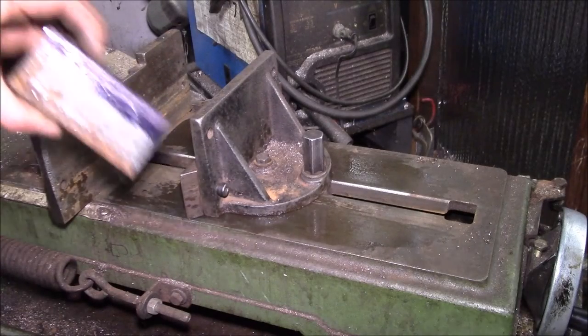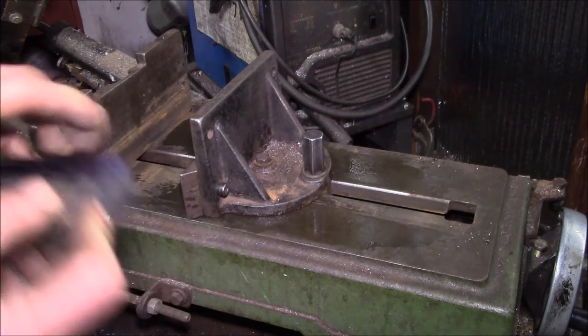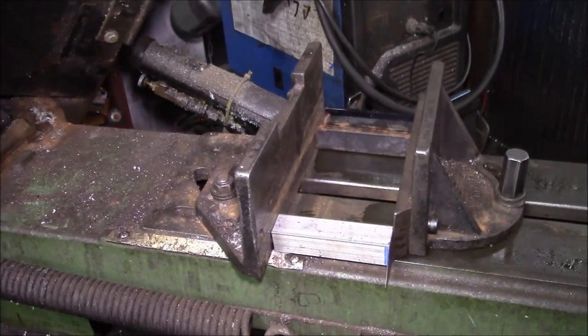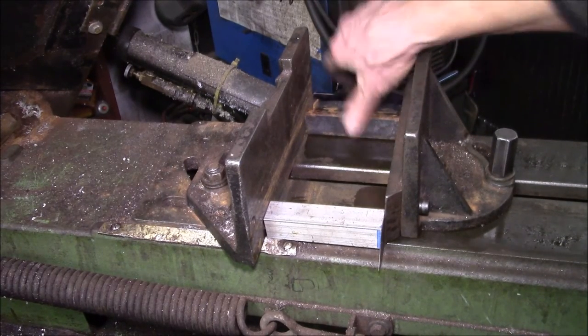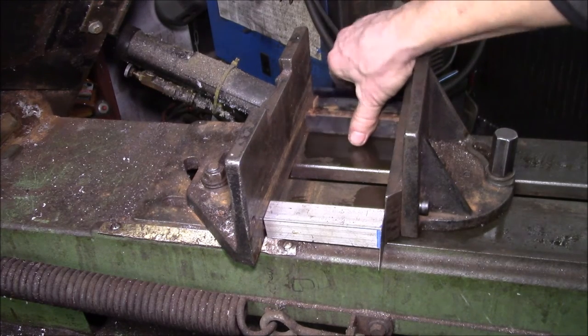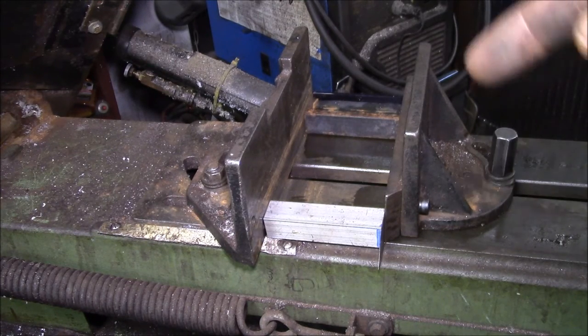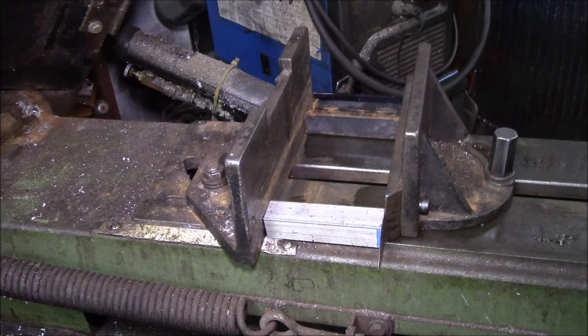I was trying to cut a little bit off a piece of metal and it just wouldn't grab the sides very well. I had a spacer in the back that was causing a problem — when I put the saw blade down to start cutting, it was pivoting on the front and the back would lift up. But now I've got the back held down pretty good. If anyone has any questions, post them in the comments below. I'll put the earlier half nut video on the left side — check that out, and as always, thanks for watching.